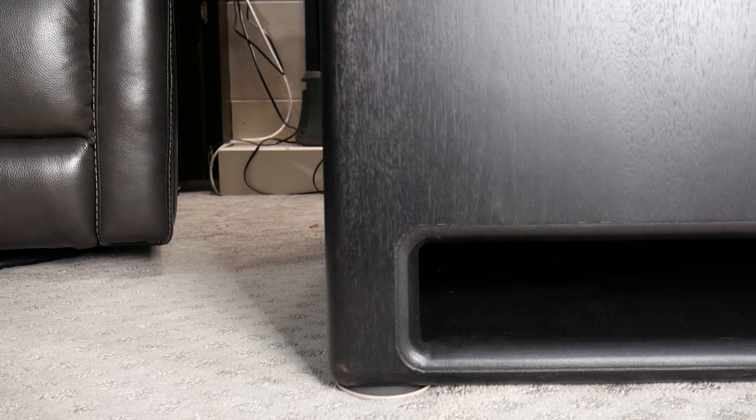It has a large 5-inch aluminum voice coil. Pushing around that massive cone is a high-energy 9-inch diameter neodymium magnet motor structure. To help reduce distortion is a full-length aluminum shorting ring. And the surround is a beefy treated foam that allows for a staggering 3-inch peak-to-peak excursion. The spider is 10-inch in diameter with under-spider venting. It is all assembled with high-temperature epoxies, and it is all housed in a sturdy cast aluminum frame.